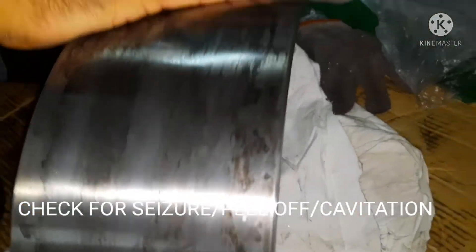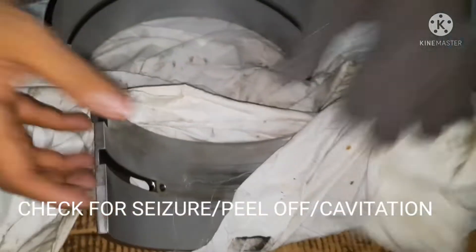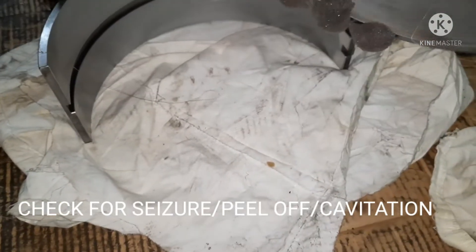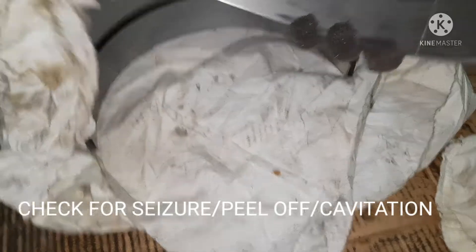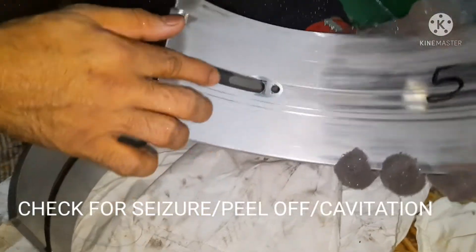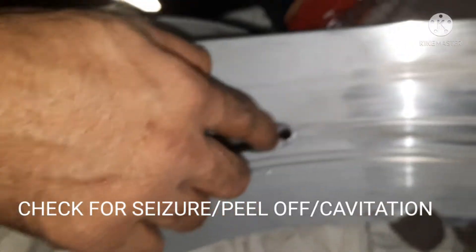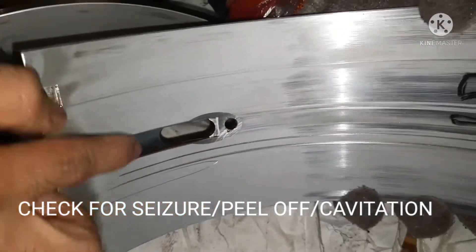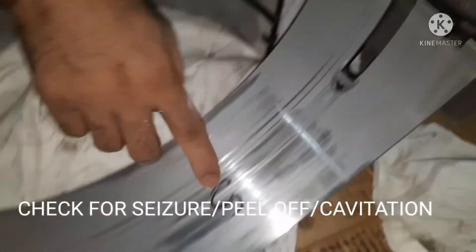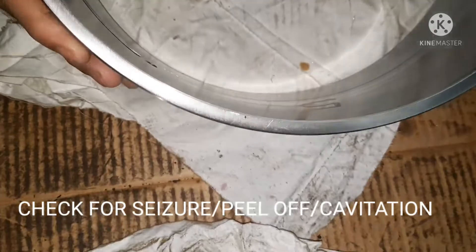Check the condition of the slot and the groove. Outside the bearing, check for any fretting marks, hard deposits, or any sunken foreign material — you can feel it with your bare hands to detect any obstruction. Do the same for the bottom side bearing. The bottom and top side bearings have different design features and different oil flow paths. The top has a hole and a groove for lube oil flow, so check whether the hole is okay and if there is any cavitation mark or damage in the hole or along the oil path.